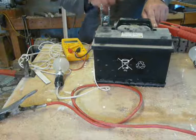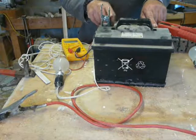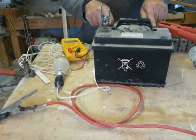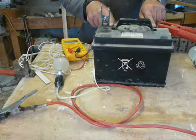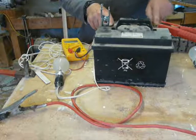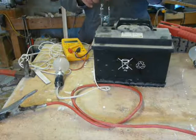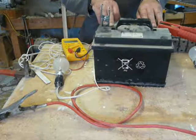This is very handy — I use it to keep my tractor battery charged up. Any surplus batteries in good condition, you can't just leave them on the shelf. They go flat, and lead acid batteries don't like going very flat as they will self-discharge. So just leave them on a trickle — I've got some on 100 watt 240 volt light bulbs downstairs just keeping the voltage up. It's better than letting them self-discharge and become scrap.